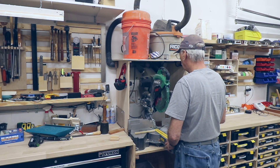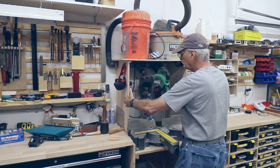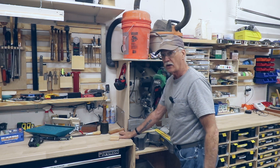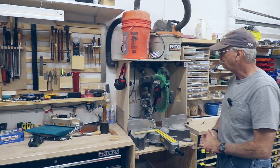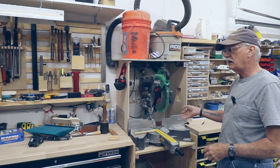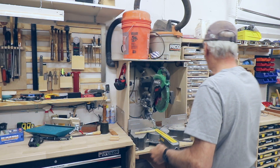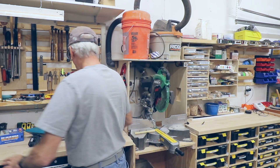The other thing I want to do is make the box wider. That's going to be really easy to do — I've got plenty of wood up here for that. I've got plenty of space here and here where I can take the box and mount it up onto the bench itself here and here to make the box wider, just so I have more room to move things around. I also want to run the T-tracks on both the left-hand side and the right-hand side, to allow stop blocks on both sides.